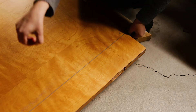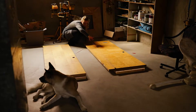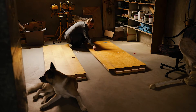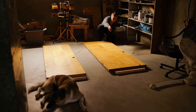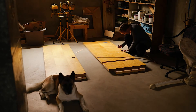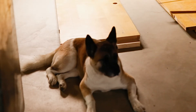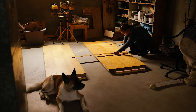You can see here I am measuring the doors and then snapping lines to mark where the trim is going to go. Each door was actually a different size, so I couldn't just cookie-cutter this — I had to measure specifically for each door. What I decided to do to make them all look the same was to measure five inches from the edges, so they all had the same border around them and would look similar without all being the same size.